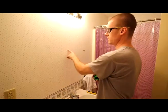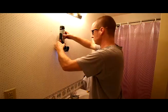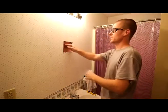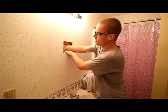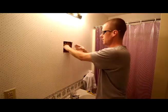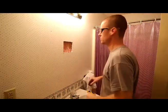So what I'm going to do is cut a hole in here so I can see exactly what's going on, make sure I don't have any electrical wires or anything I'll be going into. I've got my initial small hole cut — there's insulation here because this is an exterior wall. I was able to reach in and verify that there are studs there, and reaching up making sure there's no electrical wires, because I do have a light fixture here. No plumbing at this height so I don't have to really worry about cutting in. I made sure I was cutting just through the sheetrock so if there was anything I wouldn't hit it. I don't want water gushing out of a wall or getting shocked by electricity.